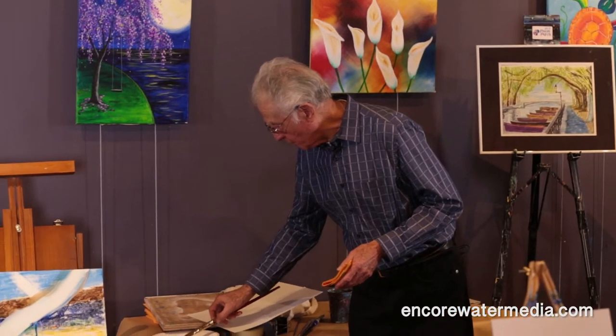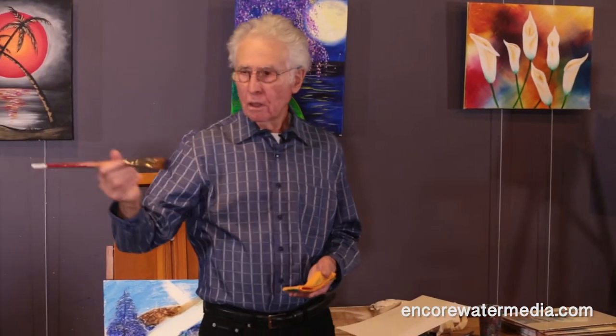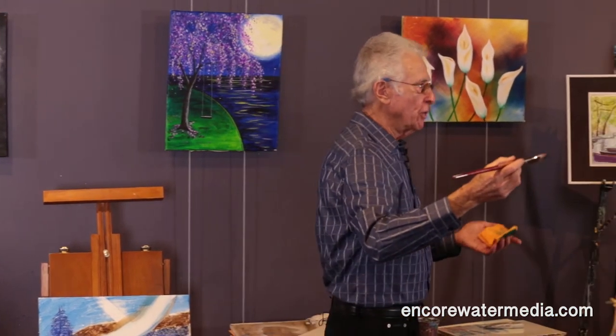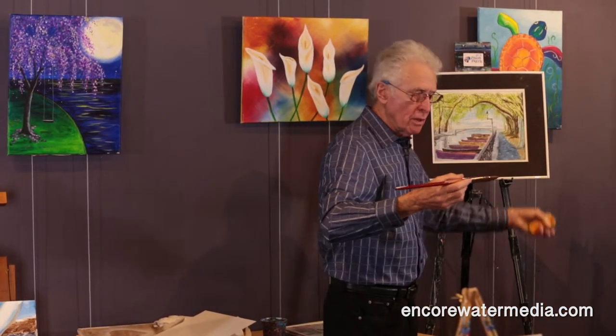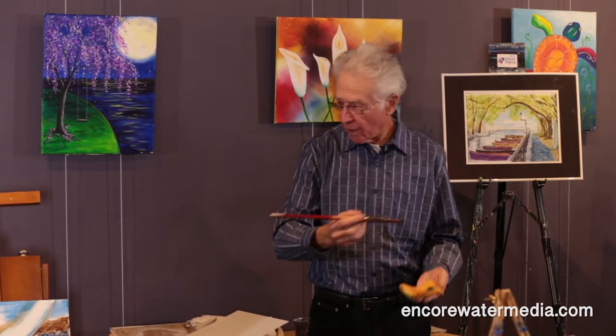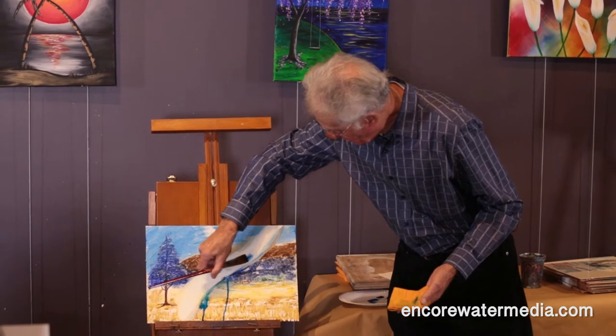The way you do that — notice when I dipped the brush into the paint, I didn't just poke it down into the paint. The paint is only on one side of the brush; the other side doesn't have any paint on it. So you can use the microfiber cloth — wring it out — to absorb the excess paint. It only takes a second.